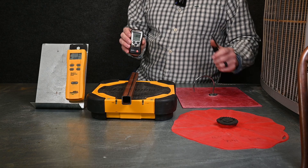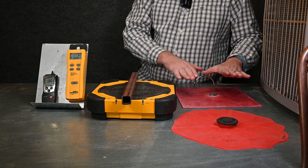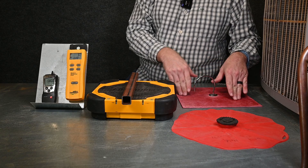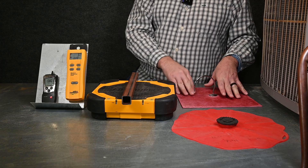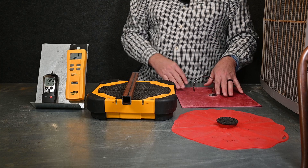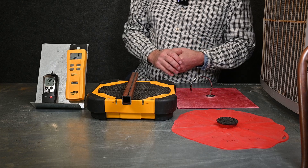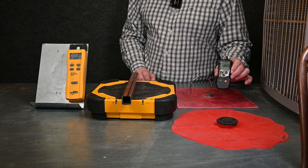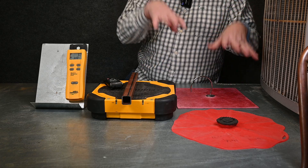Now we're not at sea level, so if I pull up my little handy tool, we're actually at 13.8 psi right now — that's the atmospheric pressure in my studio. So there's 13.8 pounds per square inch pushing on this mat at all times right now. As we go higher in altitude, we end up with less and less pressure pushing on every part of this. As you get up into the mountains — Colorado or anywhere at high altitude — there's less pressure pushing down. Go lower in the atmosphere and you have more and more pressure. For example, Death Valley is below sea level, so you could end up with greater than 14.7 — even 15 psi. A lot of people just round to 15 to make math easier, but I prefer to find out the actual atmospheric conditions you're working with and use that number. If you're going to round, I'd rather round down to 14 since it's more accurate in most cases. Traveling the world and checking atmospheric conditions, I don't think I've ever seen 15, but I see 14 and 13.8 pretty regularly.